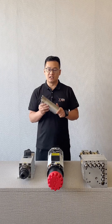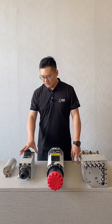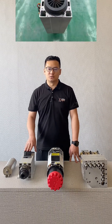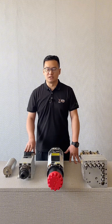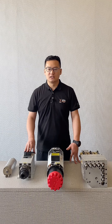Their price is relatively lower. They are more commonly used in advertising engraving machines, rotary carving machines, and relief carving machines. The next one is the more common air-cooled spindle, which relies on the high-speed rotation of a fan at the top to remove the heat generated by the spindle. Air-cooled spindles offer better cost-effectiveness and are often used in multi-process CNC routers, edge banding machines, and drilling machines.